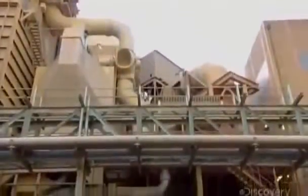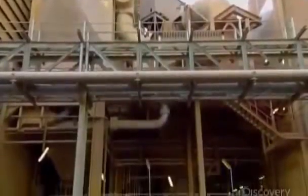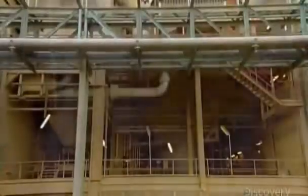The filter cake falls in chunks onto a screw conveyor and ends up at the top of a towering spray dryer. Inside, machinery presses the highly concentrated pigment through the holes of a rotating disc. This causes a spray of droplets that, when exposed to hot air, dries into pigment particles. This yellow pigment is now ready to be mixed into an emulsion paint for coloring wallpaper.